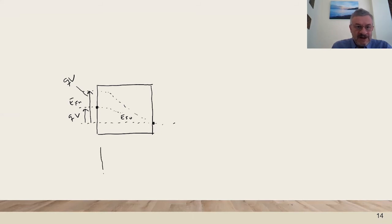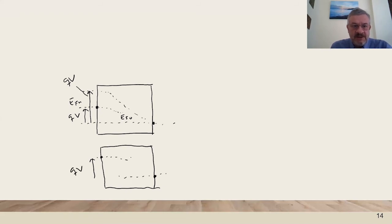So when we create a difference of Fermi level, and this is the central idea of energy devices, we now create a difference of Fermi levels in the device, and then we are obtaining a voltage because these two points are different. It can be a battery, or it can be by photogeneration, a solar cell, etc. But then this is the way that a device produces energy, because we have achieved a separation of the Fermi levels, different at the two sides.